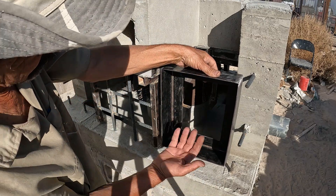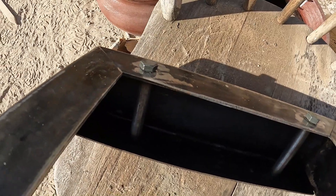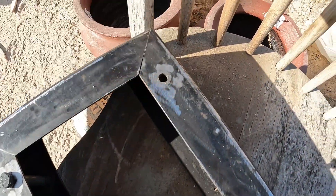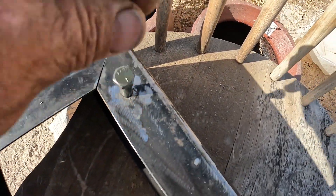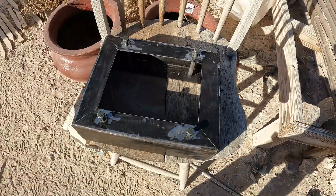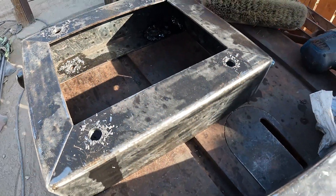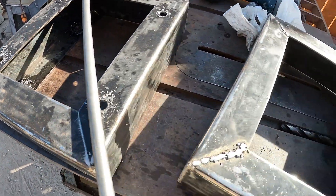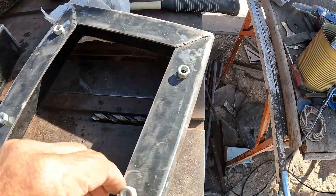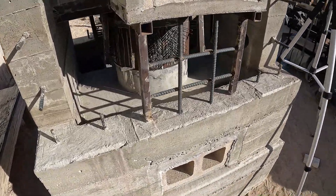I know it's overkill, but this is free material laying in the yard. I have this half inch tube sleeve so it won't collapse and crack the concrete when I fill it. All welded in, loaded the little tubes in. I had to go to Tractor Supply of all places — they had that half inch round tubing, exactly what I needed. Tomorrow I'll get the sleeves in this one and get the nuts welded on these. Once I get that done, this is ready to put in place. Some of these projects, I don't know what I'm getting into until I get in the middle of them, and I usually go overboard.